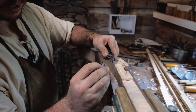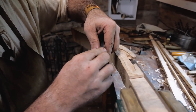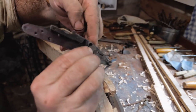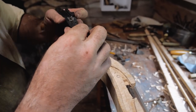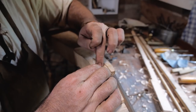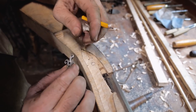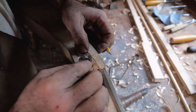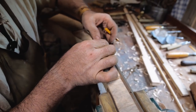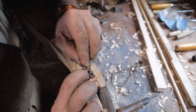If you put the tumbler in, this center hole is where you put it through this pin right here. So here's our top hole and here's our bottom hole. If you flip the lock over, that's how it's going to go in. Take the bridle back out, flip it over — your little hole in the middle of the bridle goes in the center of your big circle, your other hole goes on this mark up here, and this hole goes on this bottom mark here. Hold it down with a finger and trace it out.